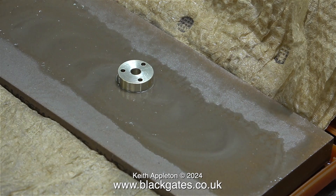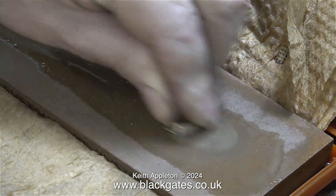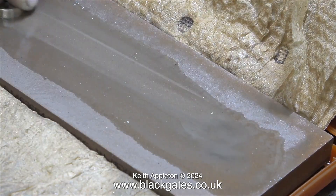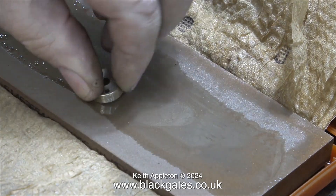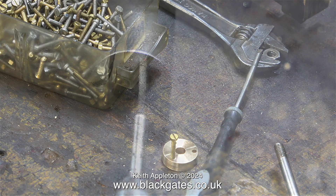It's quite important that these components are flat, because they're going to be holding an O-ring into a recess, and I'm not convinced this is going to work, but anyway I'll go along with it for the moment. These outer gland covers are held to the main gland on the steam chest using 8BA bolts. Mine are just flat and quite different to the ones shown on the drawing, but I never did like them.